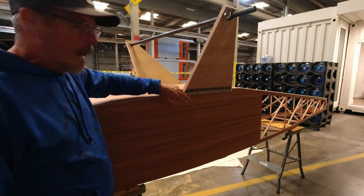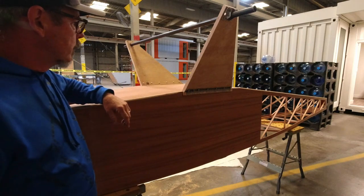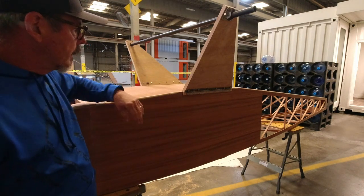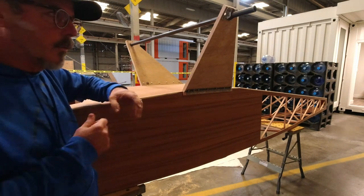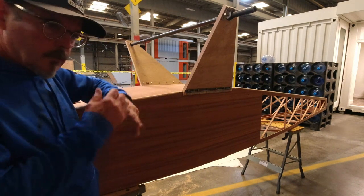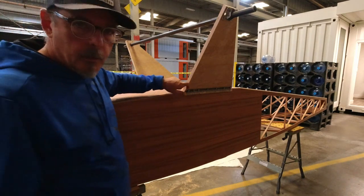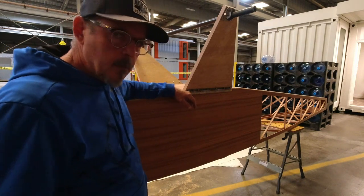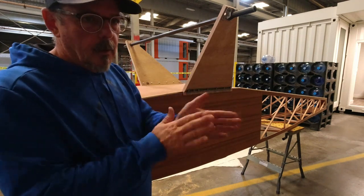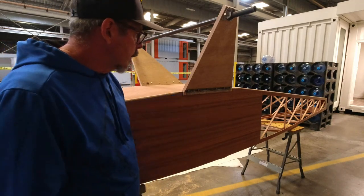And so now I'm just going to throw my clamp back up here and hold this while I drill these holes. I'm going to start the hole, and then I'm going to make myself a block with a square 3/16 hole in it that's drilled with the drill press, and then I can use that to hold up here to ensure that I'm drilling straight through. If I just use my drill, it can move sideways or up and down. I just want to make sure they're nice and square to the board here.